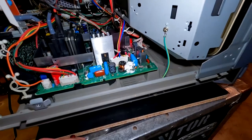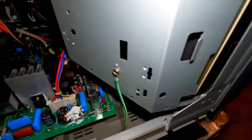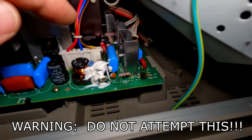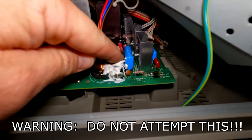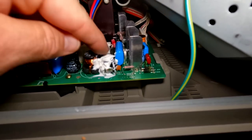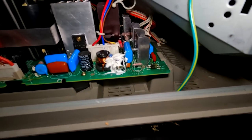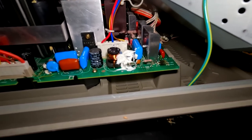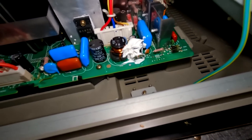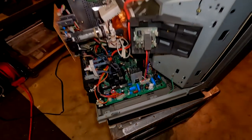I've just powered it up and you can hear a loud ringing sound. That's actually coming from this little part here that I tried to cover in caulk before to eliminate the vibration, but we need to go ahead and just replace this part. You shouldn't touch that with your hands, but that's one of the ways to find out if these parts are bad — to find out which coil exactly is vibrating, because any of these coils can end up vibrating and causing that noise distortion.